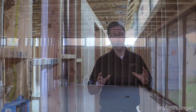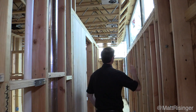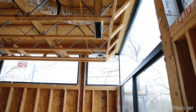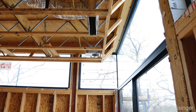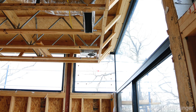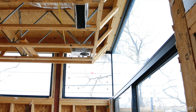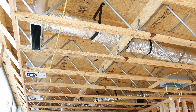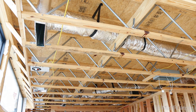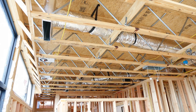Let's go upstairs and I'll show you that dramatic picture from the outside. Alright, so we're upstairs now — look at this dramatic western window right here behind me. It's running all the way up to that wide-flange I-beam. That's about an 8 to 10 inch tall beam, and it enabled us to actually use butt glazing on this corner. What a dramatic view from both the outside and the inside. That was really accomplished because we used these top-hang trusses, and as you look around at this ceiling, you can see how well we were able to put the mechanicals up into that ceiling — and what a big difference that makes in a house like this where we don't have a basement space, so we're really relying on that truss depth.